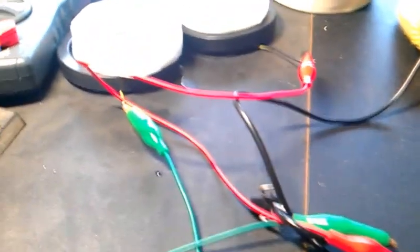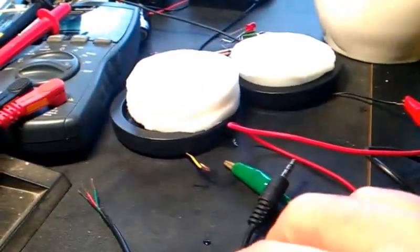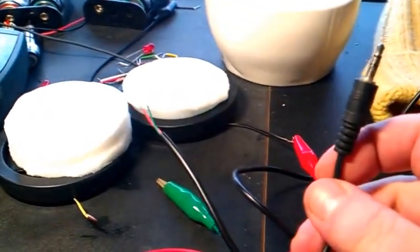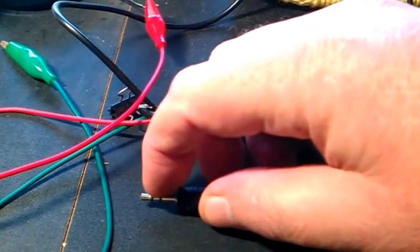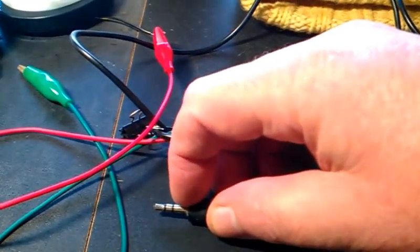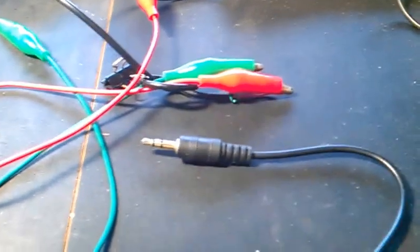How did I make the rest of this? The other thing I did was on the other end of the 22 gauge wire — I put a little curlicue on there so the alligator clips would have a better grip. The rest of it is just an old six-foot audio extension cable with eighth-inch phono jacks. It was damaged, so I cut it at the damaged place — this is the short end. The way I'm using it: there are three segments on the jack. The one closest to the base is the ground connection, the middle segment is the right audio channel, and the tip is the left audio channel. I'm using the base as ground and the tip as my incoming current from the device.